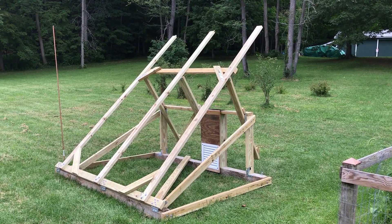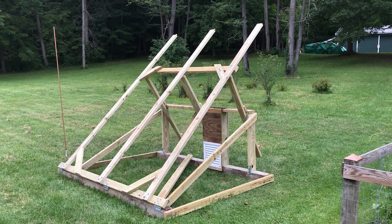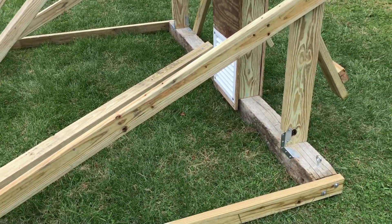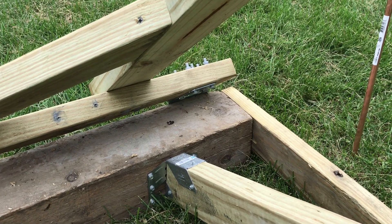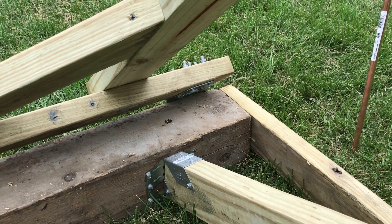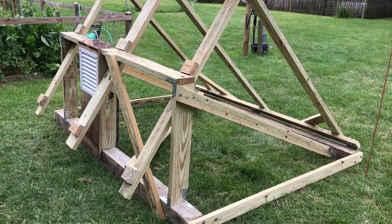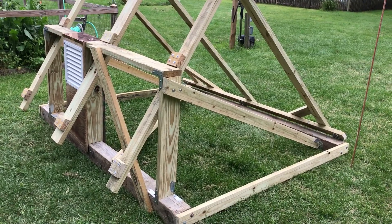Here's the adjustable solar panel mount. It's meant to work with up to eight Rich Solar 100-watt panels. The base is built out of six-by-sixes that I had around. I used pressure-treated wood and put a hinge on the six-by-six going to a two-by-four so the panel mount can swivel to different angles. In the back I've built a rail at the lowest angle of the sun for the summer, and I used a bunch of cross-bracing to keep it from parallelogramming.